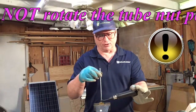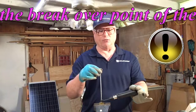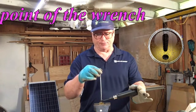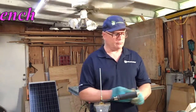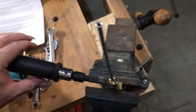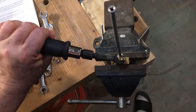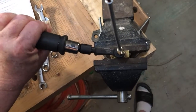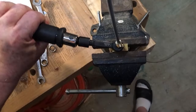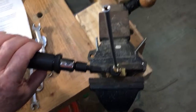You can see the wrench breaks over and does not torque anymore. Let's get an overhead shot so you can get a better view. Coming in over the top and looking down on the wrench — as I tighten, you can see the handle rotates but the wrench head does not. We are at the preset torque and this fitting is now torqued to specs.